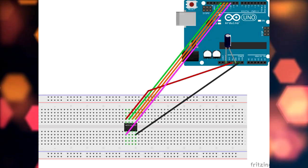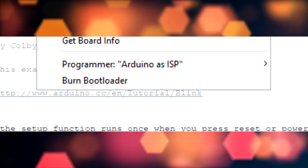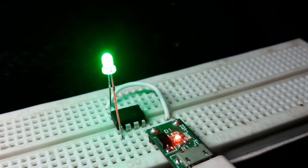The wiring is the same, so just wire everything together just like the ATtiny85. Go to Tools and select ATtiny13 as your board, set the clock to 9.6 MHz internal oscillator, then select the port and burn the bootloader. After this, go to the Sketch option and Upload Using Programmer, and you're done — you have successfully programmed the ATtiny13A.